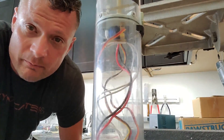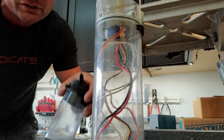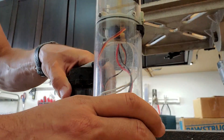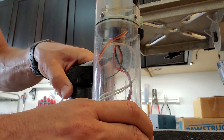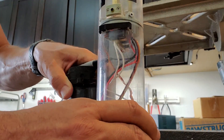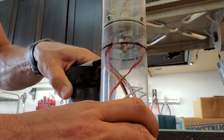Here's how I go about marking the cut line in a perfectly uniform manner. I've got a small spacer of the appropriate height and a perfectly level surface. I place the cylinder down and carefully rotate it with my pen against the spacer face to draw a perfectly uniform line all around the perimeter — something to trace when I do my cutting.